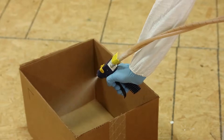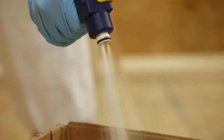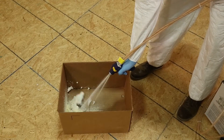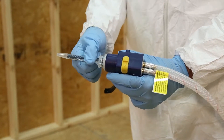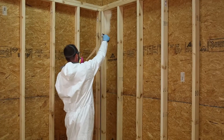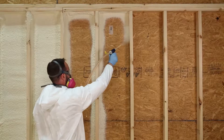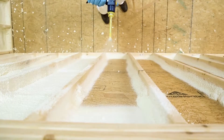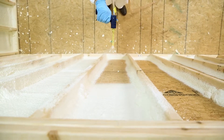Before you put on the nozzle, dispense foam into a disposable container and verify you see two colors — yellow and white. This confirms that both tanks were open. Next, put on the nozzle from your kit and now you're ready to spray. We'll treat this area by applying a one-inch foam perimeter around the wall cavity, box-like a picture frame. This ensures you create an airtight seal in the corners and seams. Next, center-fill the wall cavity to create a seamless barrier against air penetration.